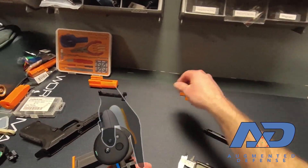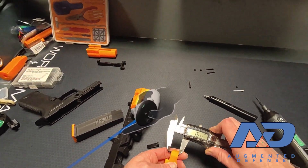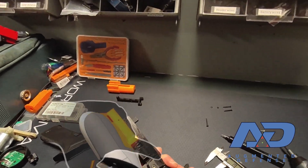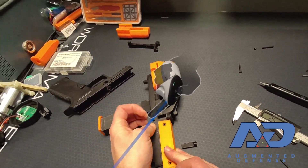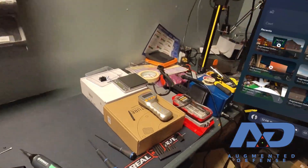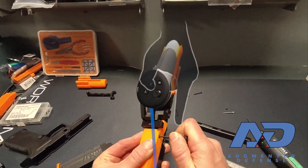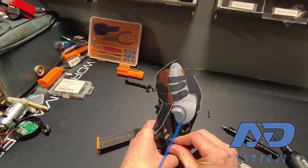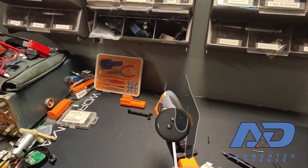Now that we have that, time for the slide. I ended up running my 20mm through there, and this screw is going to go under to the other side here, so I'll grab a 25mm. Put this nut right in there, and this will go through here. If you want, blue Loctite on both of those as well, most likely. So this end is up.